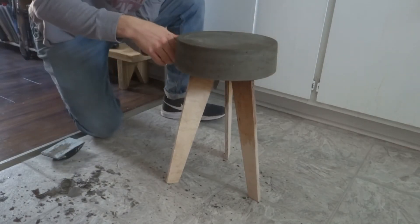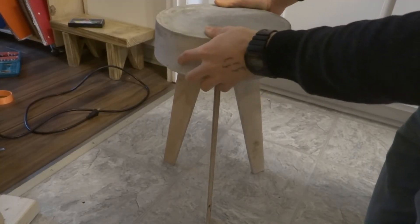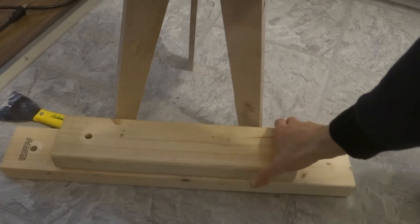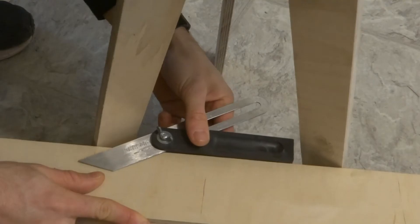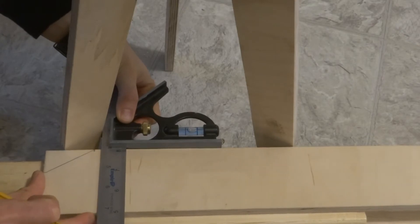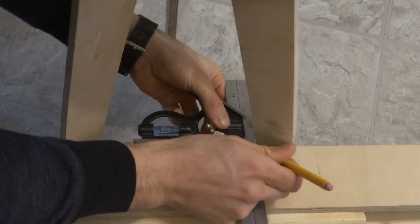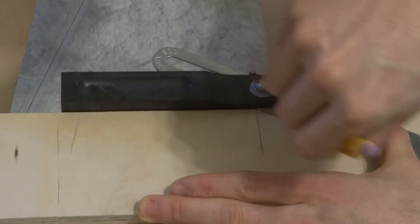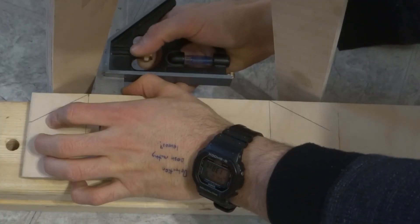I love how a three-legged stool never wobbles, but three skinny legs in this orientation don't provide much stability against twisting. To fix this, I made plywood braces to expand between the legs, elevated over the ground by the thickness of two two-by-fours. Finding the angles for these braces followed a similar procedure to hanging drywall — I butted a flat edge of plywood against two legs and used my angle gauge to copy angles onto the plywood, then used my combination square to make sure the leg edges were perfectly lined up with my lines.